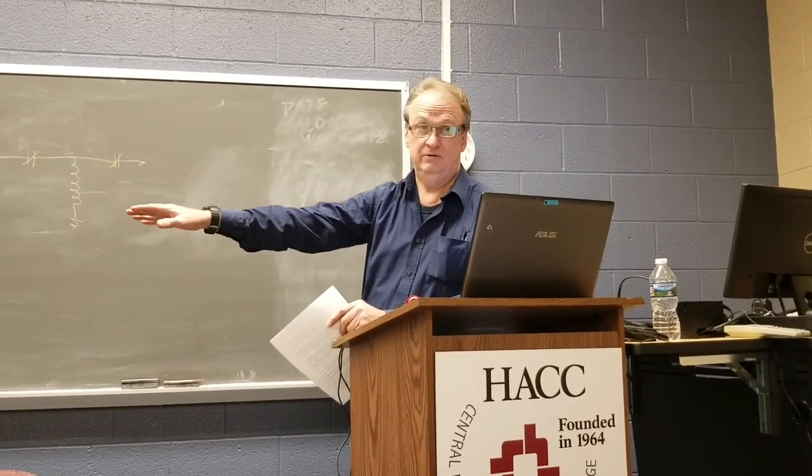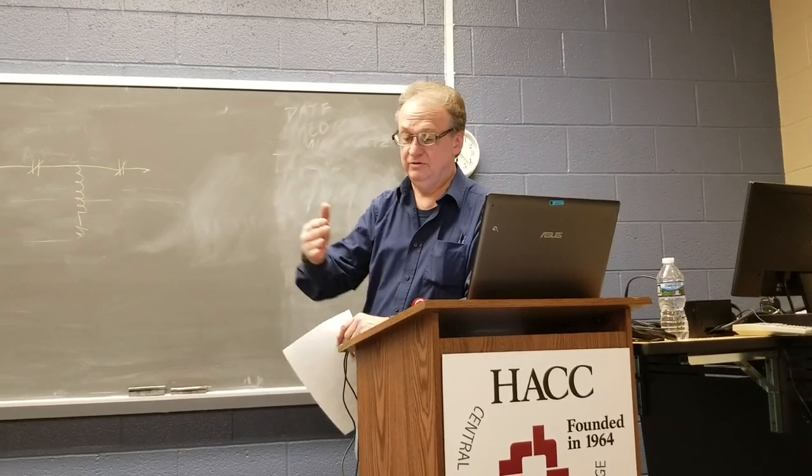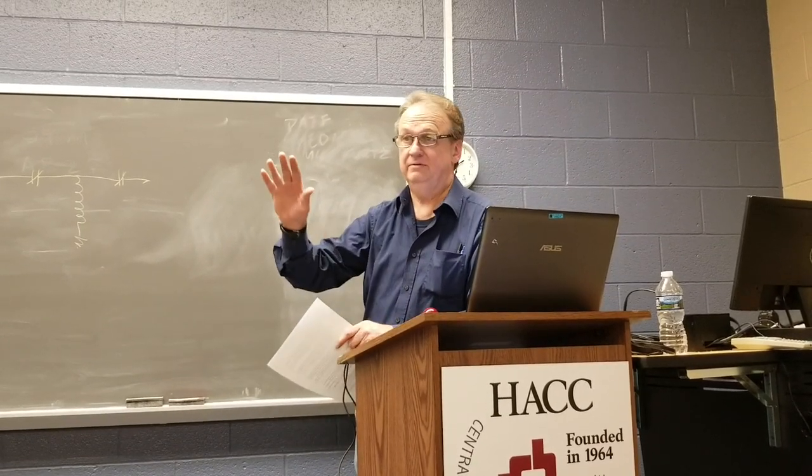Where most people don't really get the whole idea is that if you have that tuner sitting in your house, you still have a standing wave on that coax cable going out to your tower or your antenna or whatever it may be. And when you have a standing wave on that, that means your signal isn't going through. There's reflected power coming back. If you have, say, 50 watts with a bad SWR coming out of your transmitter, out of the tuner in your shack, out to that antenna, you're losing. If you're running coax cable, you're going to be losing power as it gets out to the antenna. The goal should be, for most, to have a resonant antenna.